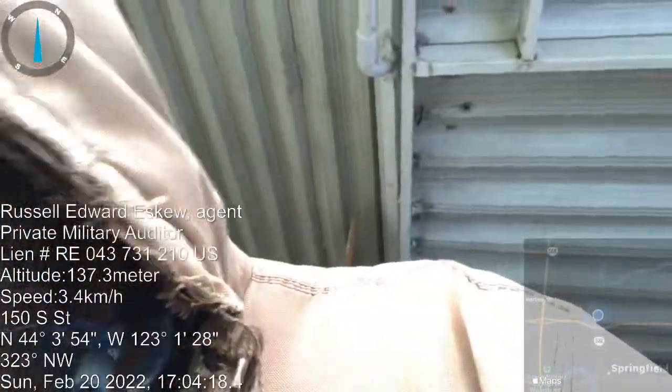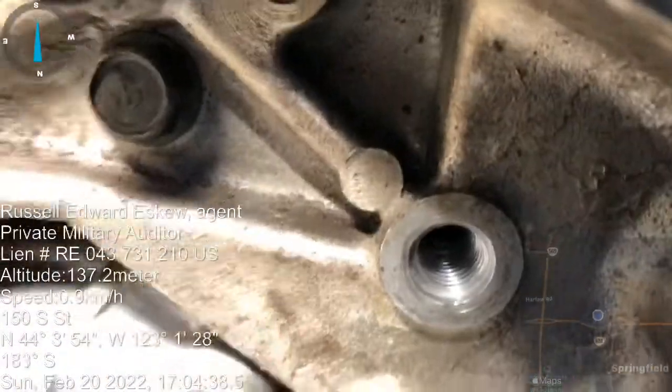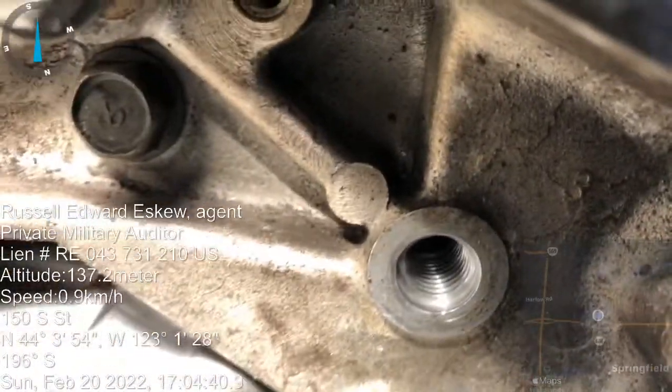So we got the 8mm set up now for the driver. It's all oiled. We drilled out the hole. Here's the hole in here. It's all drilled. That's it right there. It's all drilled and reamed out on the edge. I put the insert in. And I had a sticky bolt to put it all the way in, and it went in easy.